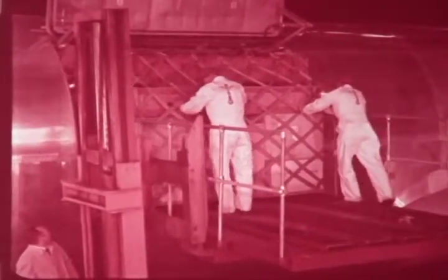With the loading of each pallet, there is some change in the level and the fore and aft slope of the aircraft floor, of course, but the change does not greatly affect the movement of loaded pallets in the aircraft. And, just as in unloading, the mast of the forklift may be adjusted to compensate for differences between the slope of the floor of the aircraft and the staging platform. Pallet loads are shaped to conform to the aircraft's fuselage. Light disposable or knockdown containers conforming to the fuselage may also be used.